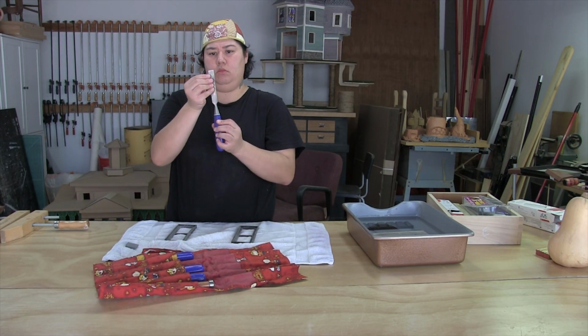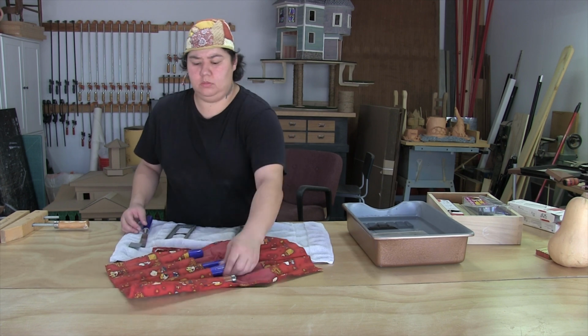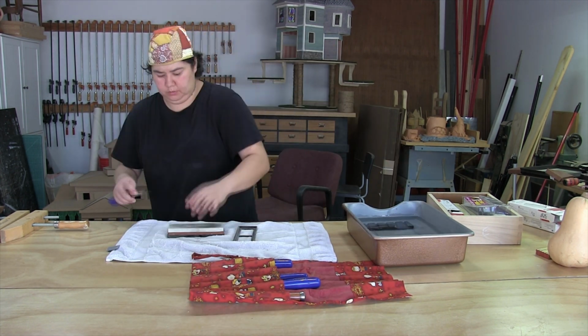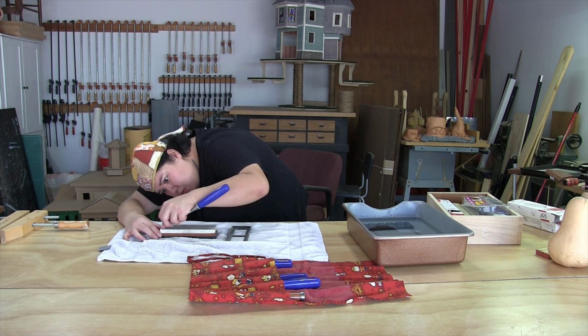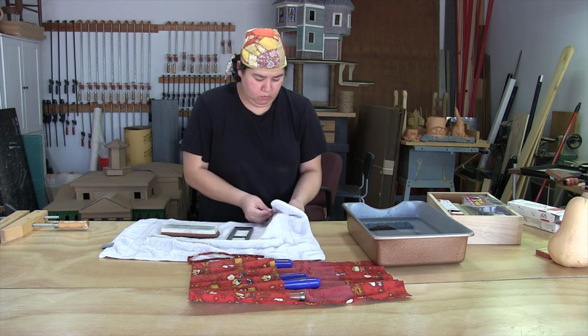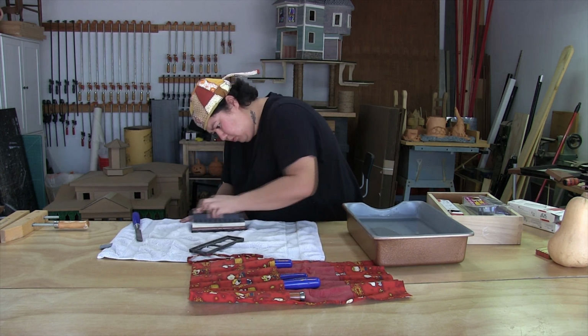Once my bends were cleaned up, it was time for some joinery. But before I could do any chisel work, they needed to be sharpened. I have a range of Japanese water stones, 800 grit to 8000. Where I start depends on the severity of my chisel's edge. If I was previously too rough on them, I might have some chipping and have to start at the 800.